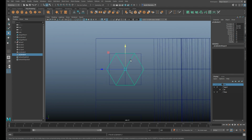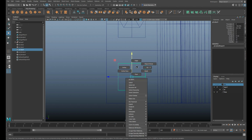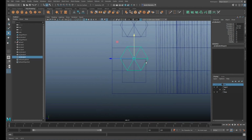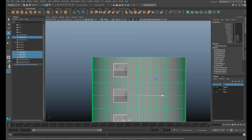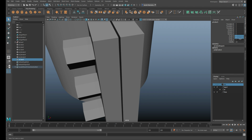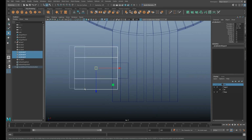And I'm going to go ahead and do the same for this one. But again, I got to find the center point for this. Likewise for this one, and for this one. I'm going to go ahead and keep these cubes so I can do it for the other side as well. So I'm going to grab these templates, bring it over to one side. The thickness of these nuts is 3.85. I'm going to grab a measuring cube so they can sit in. 3.85, but because I want it to sit in a little deeper, I'll just go straight up to 4. I'm going to bring that up front, and that's how deep we need to make these templates sit in.